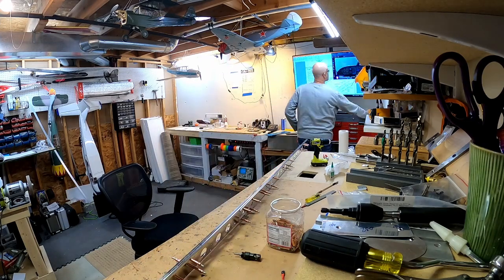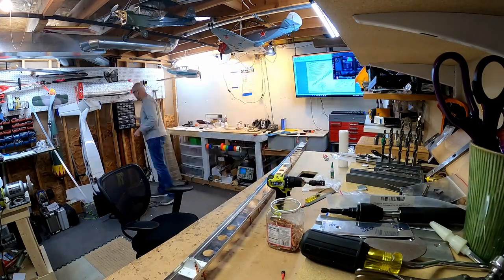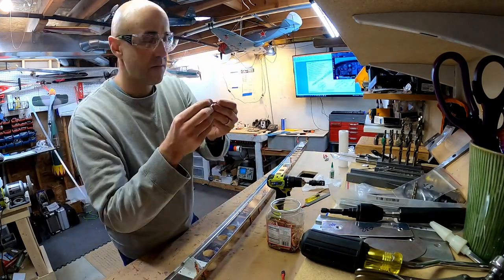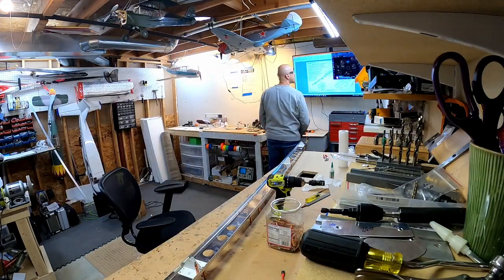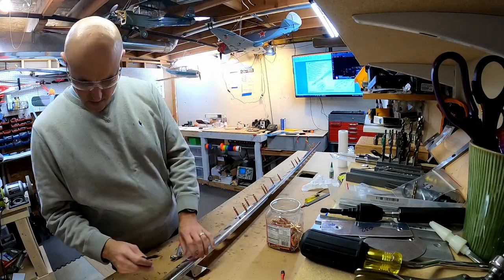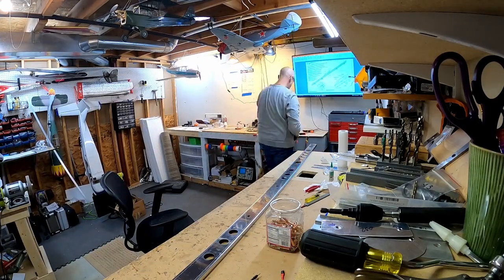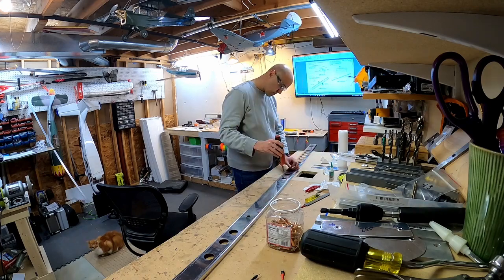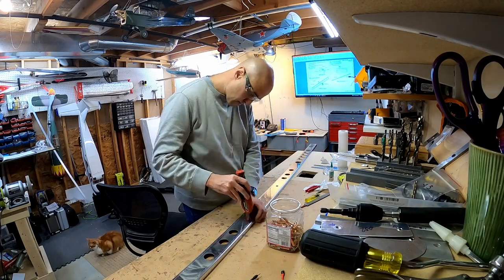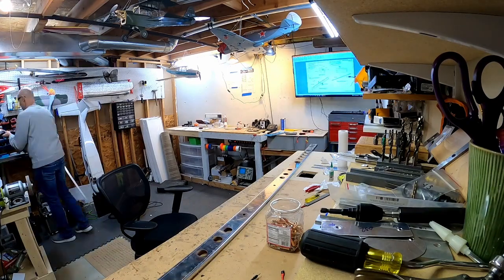Final drilling those, marking some things. Gonna mark which way is up on some of these pieces, and I believe we do some countersinking on some of these pieces as well, because we do have some flush rivets around those. There's a center attach bracket too. So super fast deburr. I don't want to keep anybody waiting, including myself.